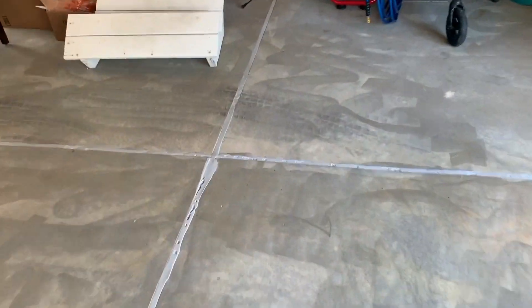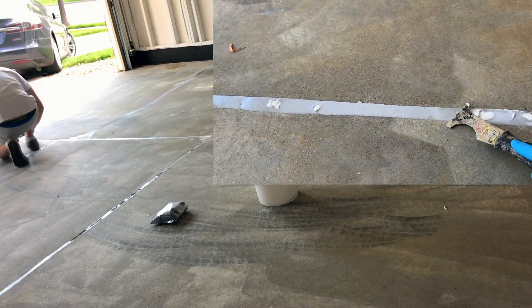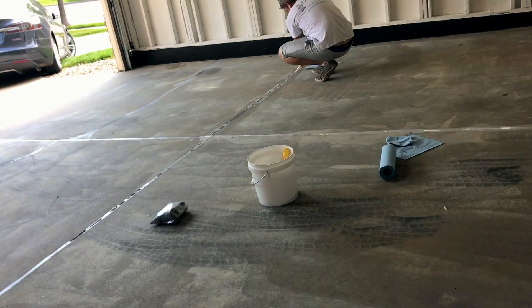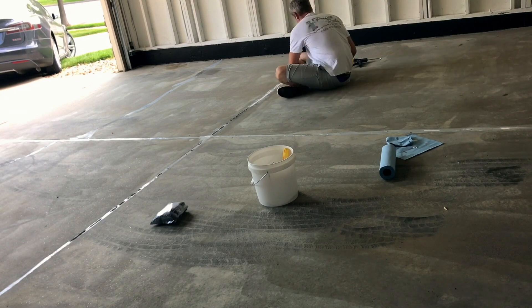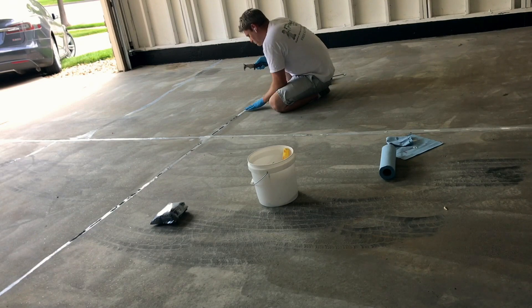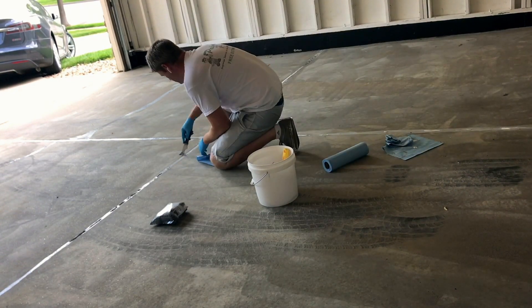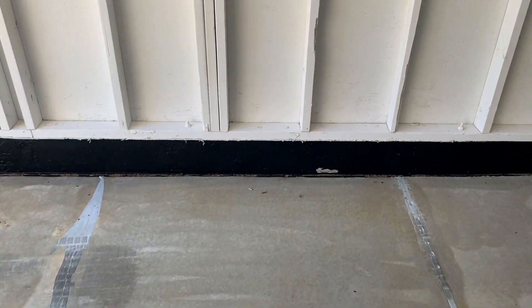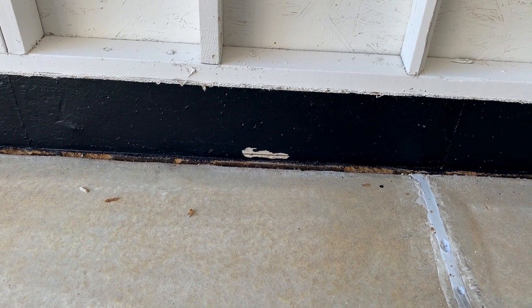If I could do it again I'd probably just use regular caulking — the self-leveling cost me time rather than saving it. I ended up using a siliconized 55-year caulk from Sherwin-Williams, putting a little in all the cut-out areas and smoothing it out with a 5-in-1 or putty knife so it was level and smooth. I was hoping the thick epoxy would cover the slab joints and look like one consistent finished floor — and it came pretty close.